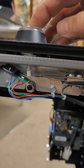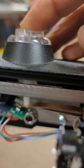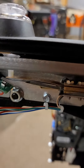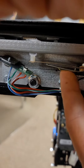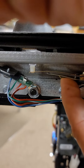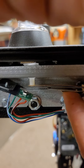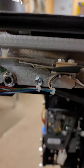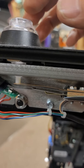Basically, that bottom blade must close. Rule of thumb for me is about halfway down — when the button's halfway down, it should be closing. So you have a little more travel and it's closing good. This bottom spring piece is what you'll work with. You're going to push it in a little bit and just close that gap. Give it a good push, but watch — if you push it too much it'll stick closed, you don't want that. Basically bring that blade up; they do sell a blade adjustment tool you can put right there, but your finger can pretty much push that closed.